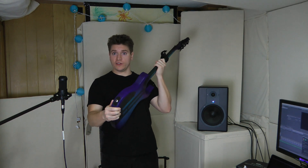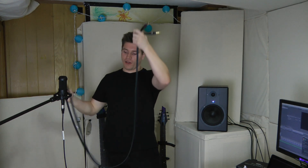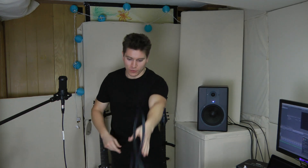On my instruments I use just a single stereo jack — looks the same as a mono jack from the outside. I plug in a stereo cable, which looks like a mono cable except you see two little rings instead of one, for a tip-ring-sleeve connector. This particular cable I use has two cables glued together all the way across until the end, and then splits — it's not really left and right, but you have red marked for right and blue or white for left. It doesn't matter which one you put where. I put my piezos on the red part and the magnetics on the left, which allows me to play Rocksmith with my friends using the Rocksmith cable without any extra wiring.